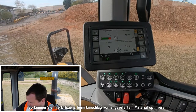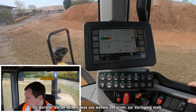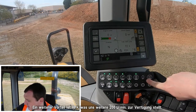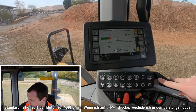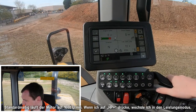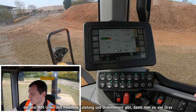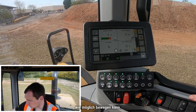This will really maximize your efficiency, especially when taking those trailer loads away. Another feature is HP Plus — as standard we are at 1600 rpm, and when you hit HP Plus that is performance mode, giving us 1800 rpm and maximum power and torque to allow you to move as much grass as possible.